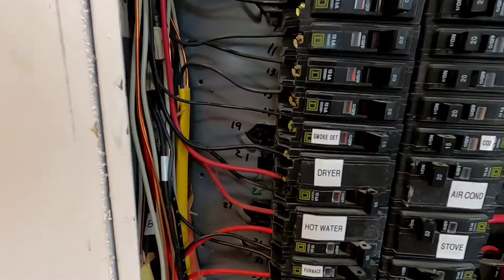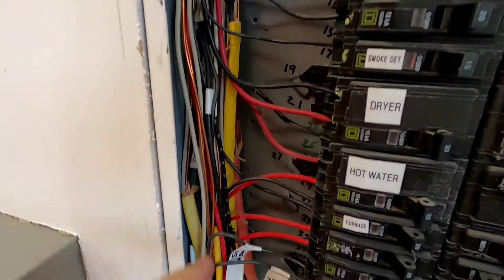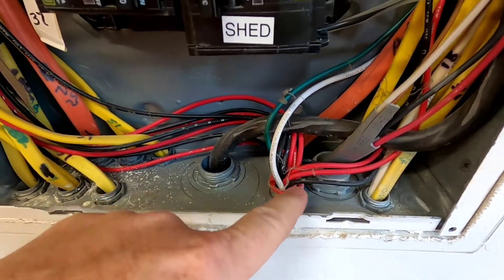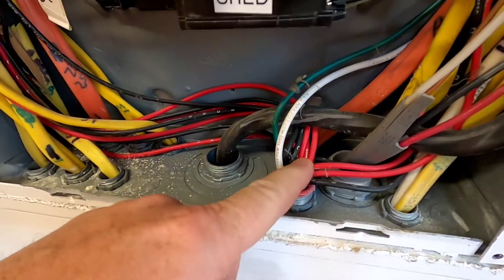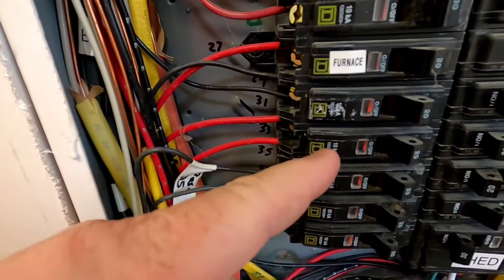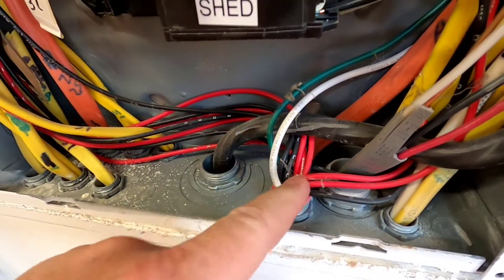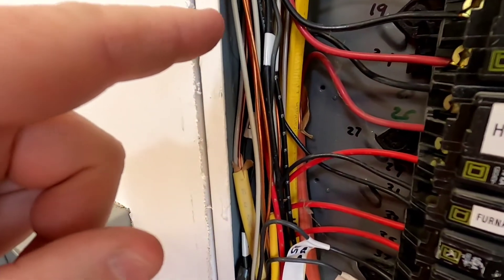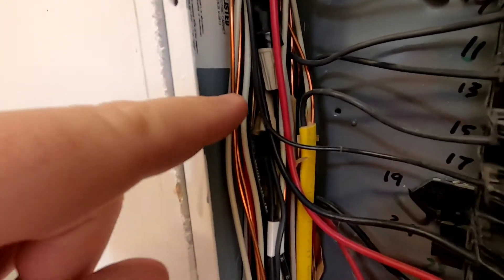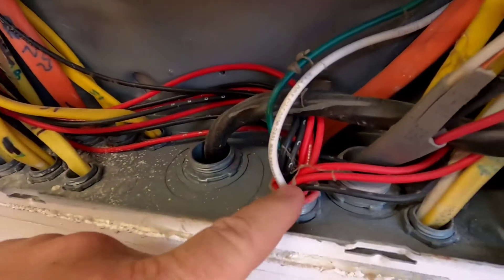Of course you're going to do all this with power off. You're going to pull that wire off and wire nut it to a wire like this. This wire harness right here goes to the bottom of this panel and comes in here. You've got a wire coming off of here that you're going to put to the breaker, then you're going to pull the wire off of the breaker and wire nut it to the wire going to this panel. The wire from the generator switch panel goes on the breaker now, and the wire going to your service gets wire nutted off to the side, and you wire nut those to a wire going to the switch panel also.